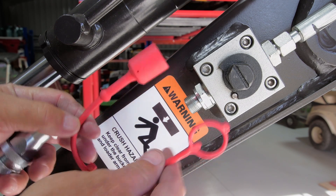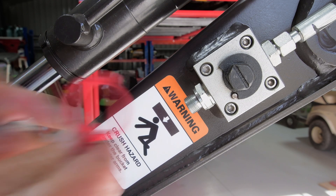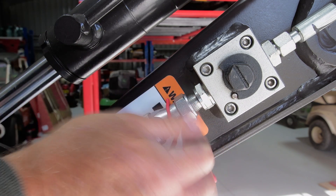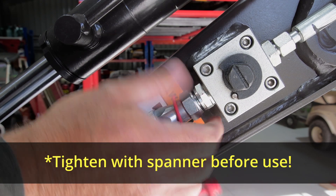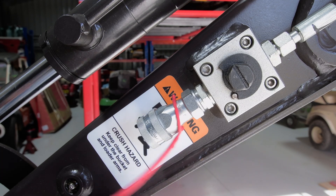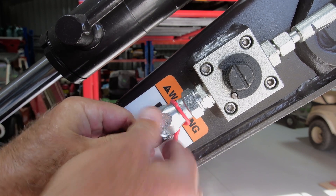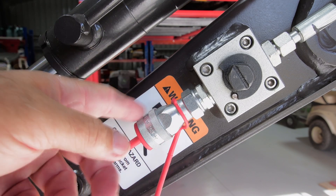The other thing I bought at the hydraulic shop were just some rubber caps. So what I'm going to do is put this on first before I screw it in — that just basically goes on there — and then we can screw this in. I'll just do it hand tight; I'm not going to do it up spanner tight at the minute. So it goes right in — you can see when it contacts that rubber seal — and there we are. The beauty of these rubber plugs, and they're really quite cheap — only a couple of dollars each — is it allows you to seal that up when you're not using any attachments and it keeps all the dirt out of that connection side.